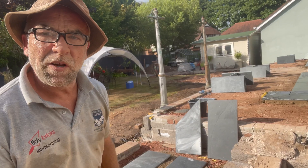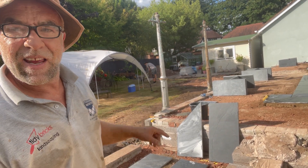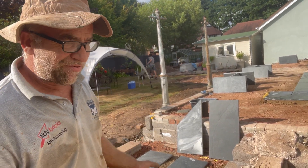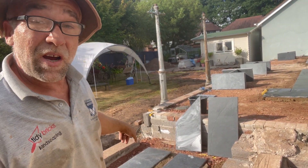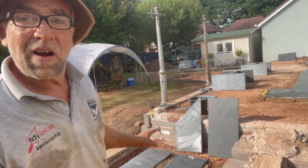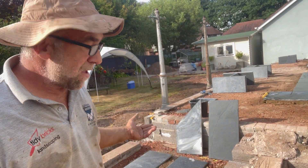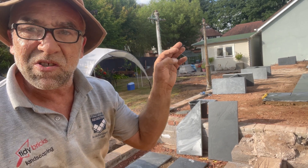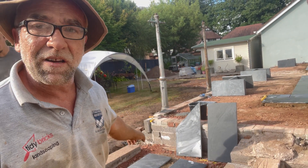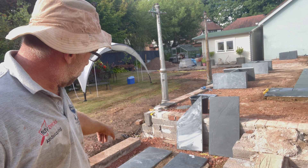Back at the end of the day now — it's literally been six hours or something. So we'll put the grabo on the tiles and see how it panned out. I know pretty much how it's going to pan out. The semi-dry — I'll pull it up and it'll just have little bits of primer and a little bit of cement stuck to it, but the cement underneath would still be absolutely fine.